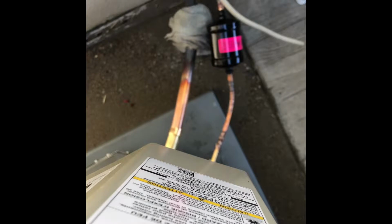And then when I'm done, this is probably still gonna be too wet, huh? I'm gonna put some anchors like here to the pad. So you know, if it moves, it won't move too much. But eventually, you wanna put some anchors in the concrete. So let it dry, to hold the pad. To hold the pad, yeah. Liquid. Yeah, so if somebody knocks into it, it won't break the lines or something.